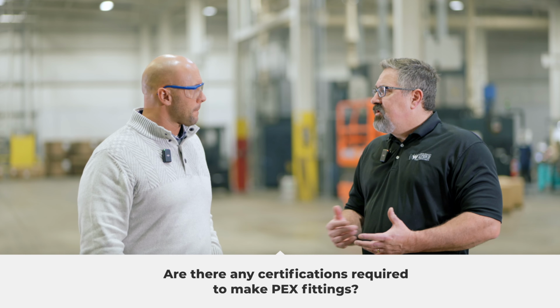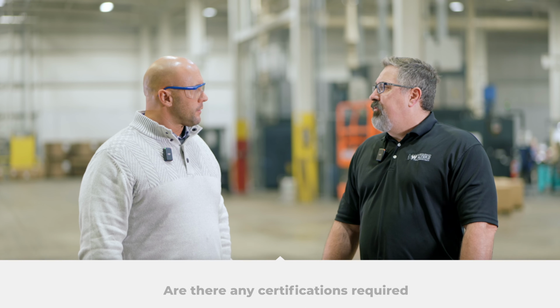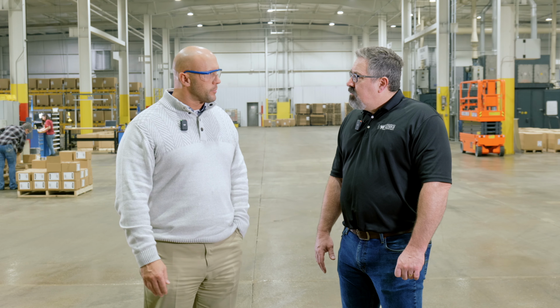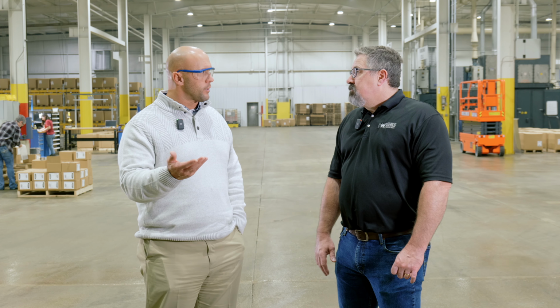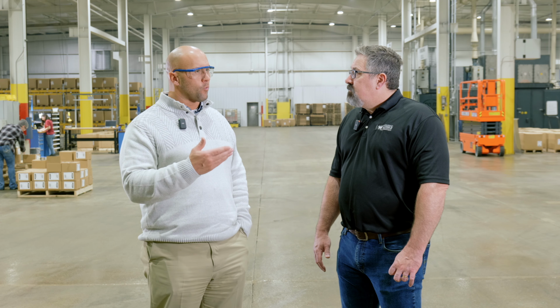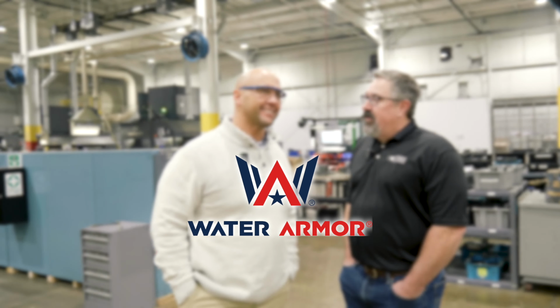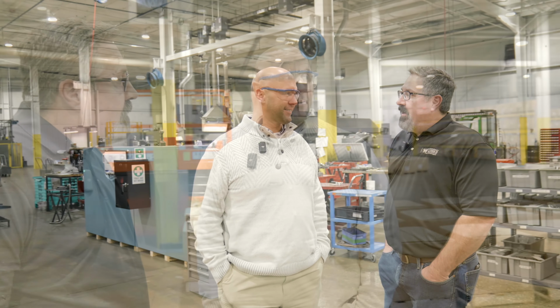Are there any certifications that are required for PEX fittings? What kind of certs do you guys go through? Yeah, we use certified raw material to ASTM. We use alloy 693, which is Eco Brass. And our Water Armor fitting line is certified to NSF and is approved for PEX applications under the 1807 product line.